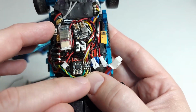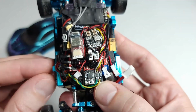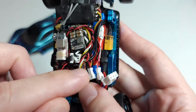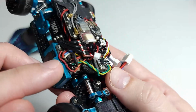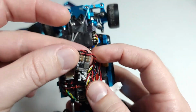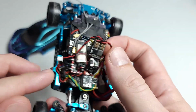And then that 8.4 volts will go out to your servo, and that would put 8.4 volts directly into my servo, and that could burn it out. So I can't just run the power directly through the gyro from my 2S battery into the servo. It would basically destroy it. So I actually have a dedicated 5-volt regulator, kind of like this one here, where I run the 8.4 volts into it, and then it steps it down to 5 volts, and the 5 volts powers my servo.